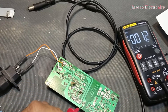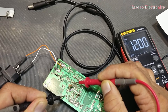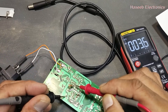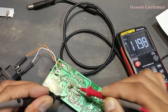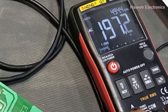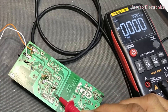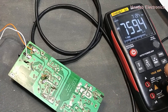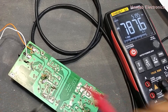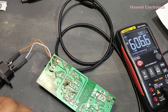The third checkpoint: we can find pin number eight — that is the 5 volt reference. Now pin seven is receiving 12 volts. Before, with the open resistor, it was not giving any voltage there. If we try to test the voltage across the primary winding, it gives 195 volts of switching voltage in the primary. We can say it is switching, but some low-quality multimeters when connected here will make a sparking or whistling sound — that is because the multimeter does not have a good frequency response.